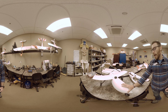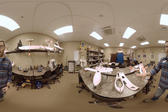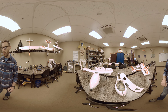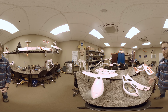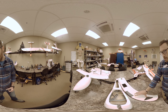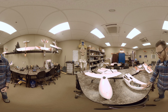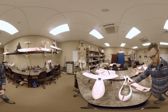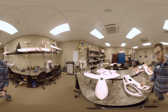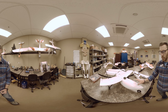Speaking of some more professional level stuff, this is an aircraft that we have for our lab called the Albatross. This is some of the work we're able to do alongside our maintenance program. One of the UAS concentrations is the technician concentration, where you learn to be an aircraft mechanic, so we shrink those skills down to aircraft at this size. You can see a wing section here that we've been doing composite repairs on, and this is a fuselage section the company provided that had been in a crash — giving students an opportunity to practice their composite repair skills.